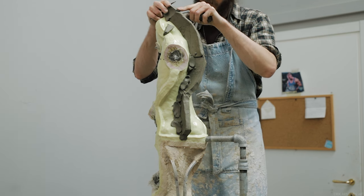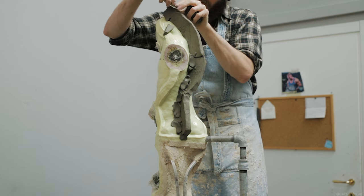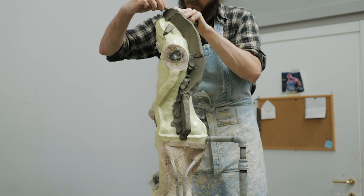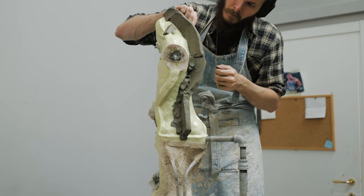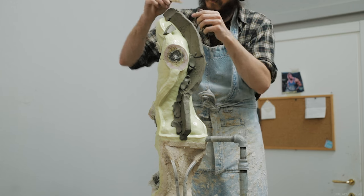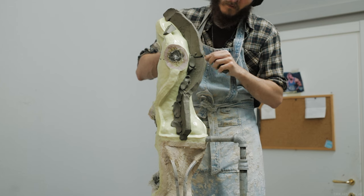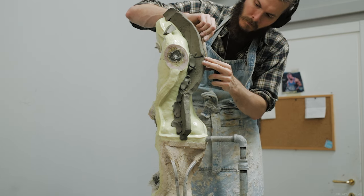All of which are rather chunky and with enough length connecting them to another piece so that we can easily run two bolts through each connection. Two bolts connecting two pieces are better than one bolt, as one bolt leaves a chance of the two pieces rotating around the anchor point of the bolt. So two bolts are better — we're always trying to make sure that we can use two bolts.